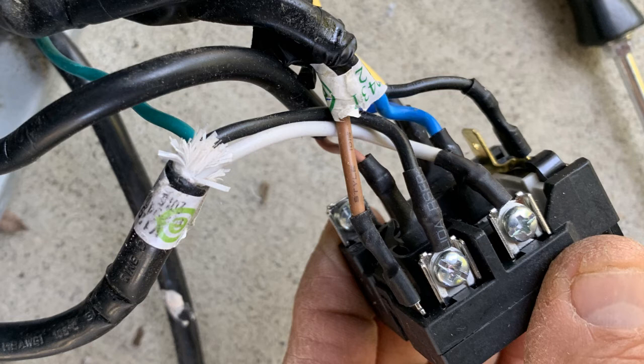There's another blue wire on the other side that connects to one of the pin sockets. You're not going to need it because that's a capacitor function, and the unit you're purchasing replaces all of that — it's already done as soon as you push the pins onto the compressor.